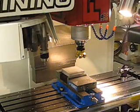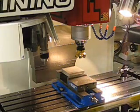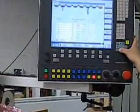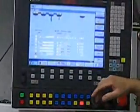Initially, I'm going to load up the part probe and find some features on this part we have in the vise. To do that, I'm going to tell the machine to load up my probe. You'll notice I have a face mill on the machine now, so I'm going to put that away and manually insert the probe.